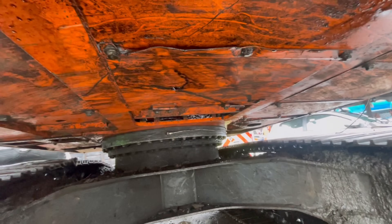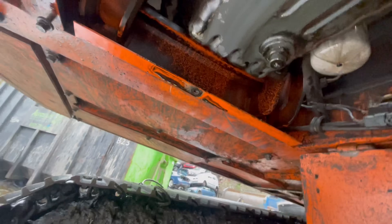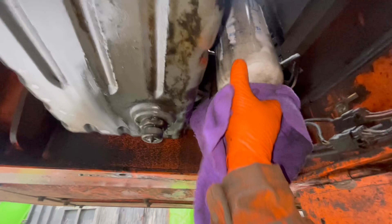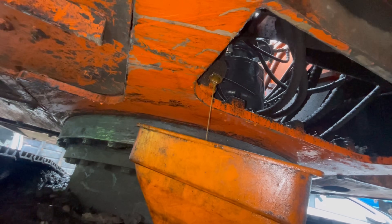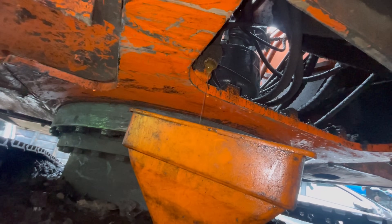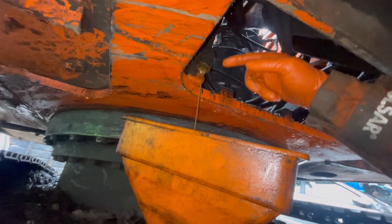The belly plate has had an accident. You can see a bit of black engine oil about. I would imagine it's off this filter head — quite often they weep oil and when dust sticks to it you get a fluffy filter. I've seen one as bad as that. It does look like it's coming from a bit further up. I'll get my torch and see where that might be coming from. The machine is majority of the time fairly stationary, but they were concerned about what the slew gearbox oil looks like given the amount of slewing they do.